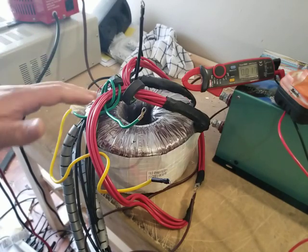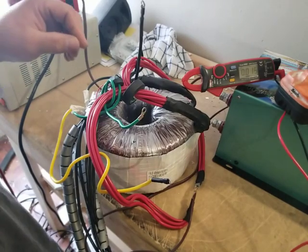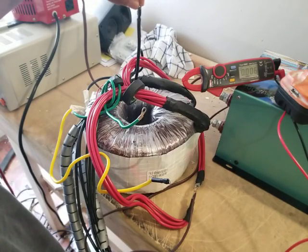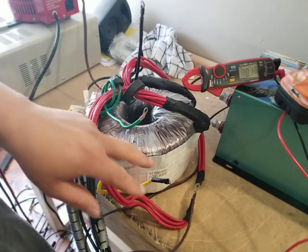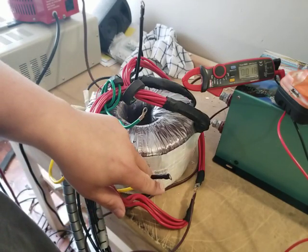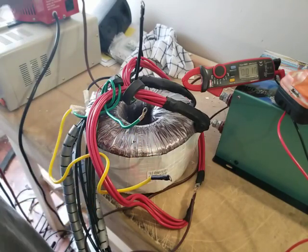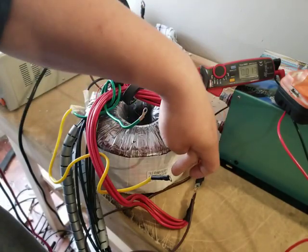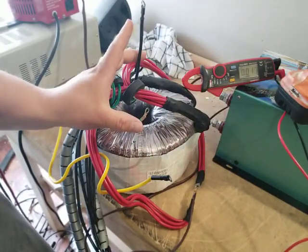For this demonstration, I'm putting in about 17 volts on my Variac. Before I energize it: you have L2, which is right here — this black wire here. L1 is actually this wire here, and this is your ground. Power Jack inverters use a floating ground, so you can combine these two here to get 240 volts. That's why that sticker is there that says 240 — 230 actually. You combine these two, you get 230.